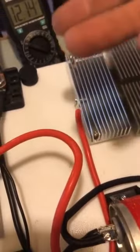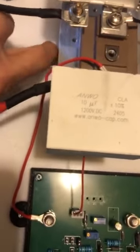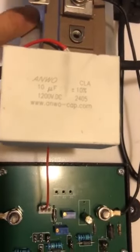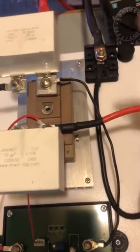Now, that end of the circuit still needs work, and so does this. But the point is, discharging to a battery, we have a very low AC inductive kickback, very low heating on the MOSFET or IGBT. He warms, but ever so slightly — there's almost nothing noticeable. Over a long period of time that may change, but we are not having a large inductive kickback here. When we go to a coil, that will change.